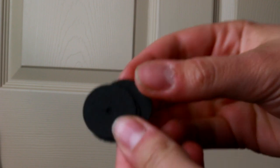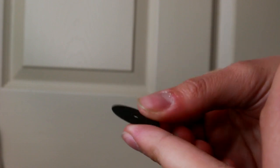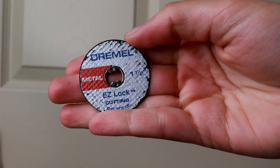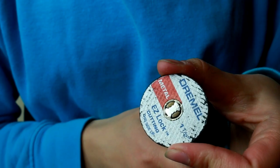The little sandpaper-thin ones — never use these. They're super dangerous. They won't cut through plastic; they will completely shatter and go flying, and you risk them embedding into your skin. Always make sure you have a reinforced proper cutting wheel designed for plastic and/or metal.